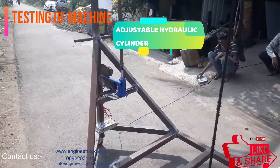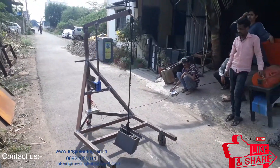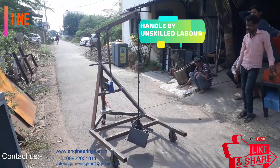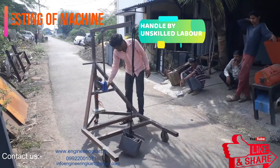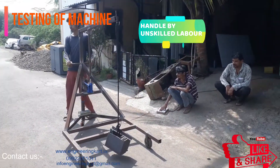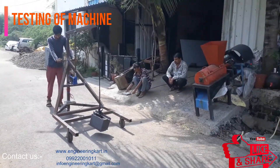It consists of a plunger cylinder on one side and a ram cylinder on the other side. These two cylinders are mounted on a base which is made of mild steel. The plunger cylinder consists of a plunger, which is used to build up the pressure by operating the handle. It also consists of a lowering screw — this is a hand-operated valve used for releasing the pressure in the ram cylinder to bring the load down. The video is showing the working and construction of the proposed mechanism.